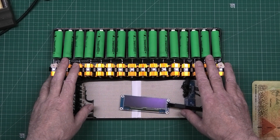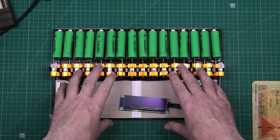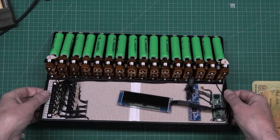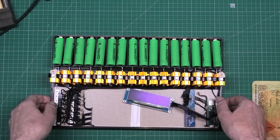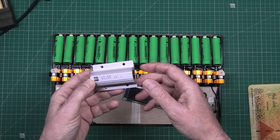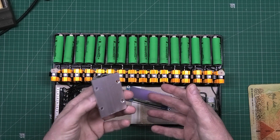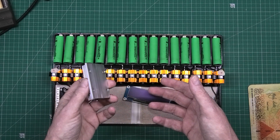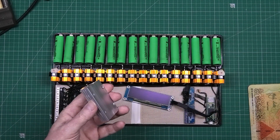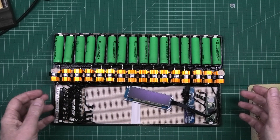At the minute I'm basically back to square one - the batteries are only monitored, not balancing or doing anything at all. The resistors are now three high, so that's 75 watts of discharge. I could have used these 100-watt 1k resistors but couldn't figure out placement, and putting them on the negative rail in parallel wouldn't let me read the voltage properly. This is the way I'm doing it.